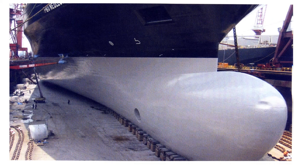You can see here from a dry dock picture how the bulbous bow is shaped depending on the purpose of the vessel and the areas it will transit. The vessel has a symbol indicating the bulbous bow located below the anchor, and a circular fan shape behind it indicates the vessel has a bow thruster. You can see the bow thruster tunnel — a hollow tunnel at the bottom of the vessel just aft of the bulbous bow. The design of the bulbous bow should be such that it creates its own waves and cancels out the waves produced by the vessel's movement. This detailed drawing gives a clear picture of the various framing systems.